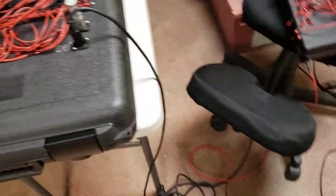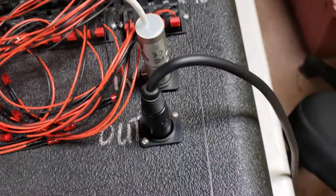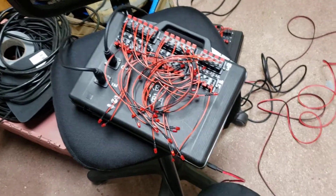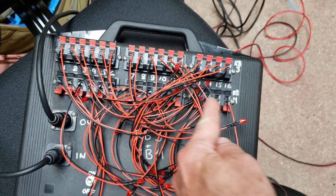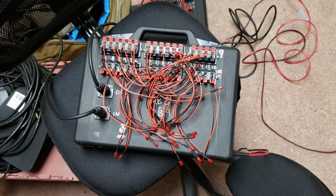I'll have to check my continuity on the igniters individually. The DMX out comes out right here, runs over to the next box. It's all crowded in here. There's 20 feet of separation between each one. Same arrangement — you've got 16 here, that's one relay board inside. Another 16 here, that's the second relay board, and all LEDs on there for testing.